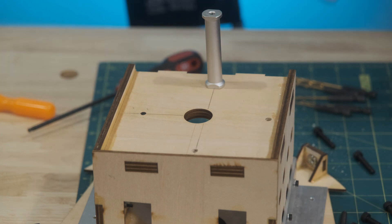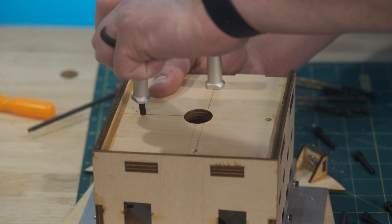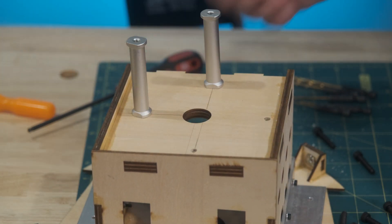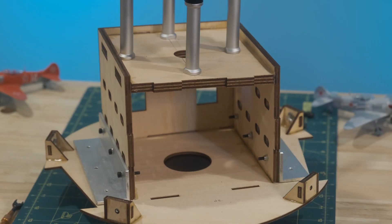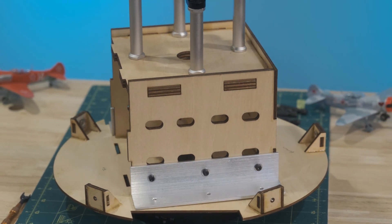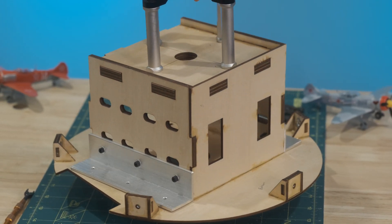We're going to need to move the motor out a little bit, and the DualSky 6000 does come with appropriate standoffs to put it in roughly the right place as a typical 60cc gas motor. In fact, it comes with extra spacers if you need about another quarter inch or so. Here is the motor mount all ready to go, turning around on a turntable. I know I have some lock nuts missing, but I just wanted to show you the finished product before we attach to the firewall.